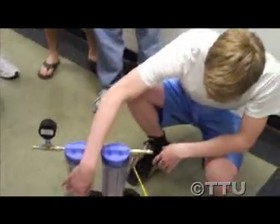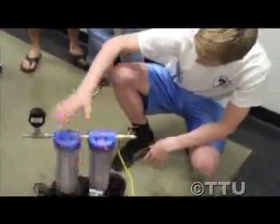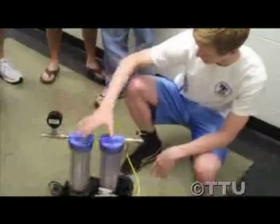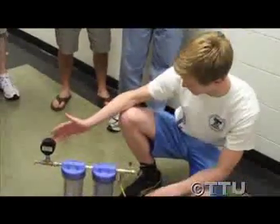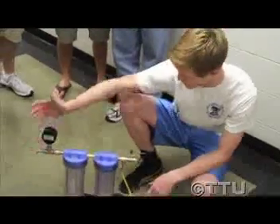We put all the yeast and glucose in this container, and we have two tanks, so we build up pressure in both. We have this digital pressure gauge here, which is where we monitor the overall pressure, because these containers aren't rated for a max operating pressure above 125 psi — so we monitor it to make sure we don't get close to that. We have relief valves that pop at 115, so we don't even get over 115.